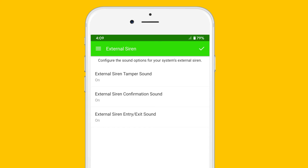It's now in arm stay or arm away — it's normally three beeps. You can come here and turn that off. Below that is the entry and exit sound. Whenever you set the alarm there will be a 30-second countdown — that's your exit delay — and it will beep every second. You can turn that off by hitting this button, and when you're happy with that, hit the top right corner to save those settings.